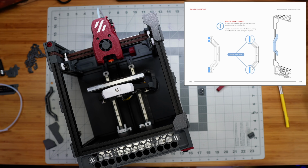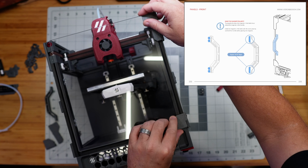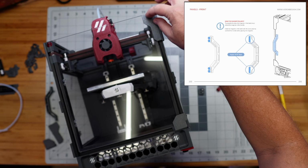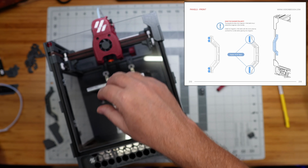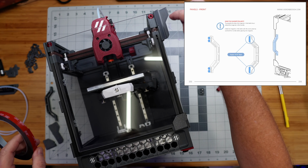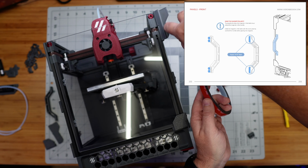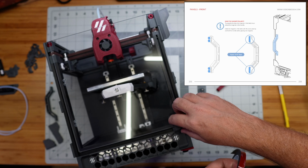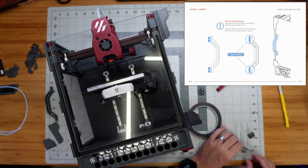Yeah, that's real good. Okay, so now I can slide my panel in place, get it lined up, and go ahead and tape these two pieces down onto the panel. So we've got our VHB tape for that. I'm just going to cut slices of the appropriate length. It looks like this is just slightly too wide to fit in this little area here, so it's just going to have to be taped up in that larger angled area up there, and then same thing down here. So I'll cut a couple pieces of that and get that stuck into place.